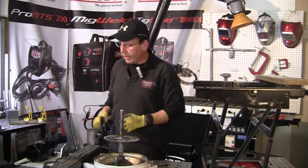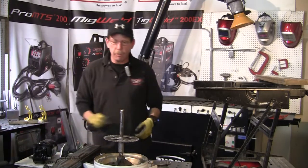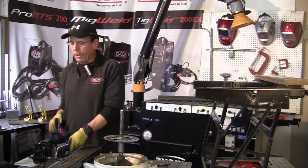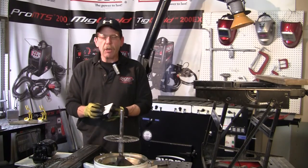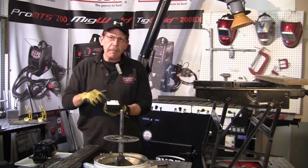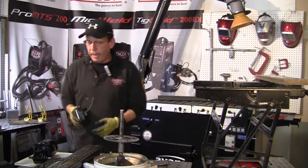The motor alone is going to be something. We've got our motor — it's a half horsepower motor, 110 volt, a typical industrial motor — but I have to modify the little gear on it, so I'm going to TIG weld that up so I can put it on the shaft. I've got my chain, and my on/off switch is also a speed control so I can go faster and slower. I've also got another part of the switch to make it go forward and reverse — handy if you're welding and want to back up a little bit.